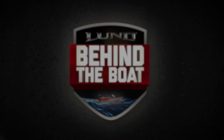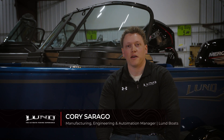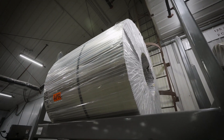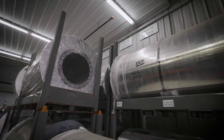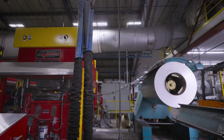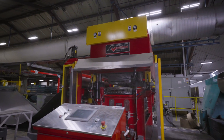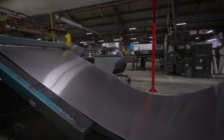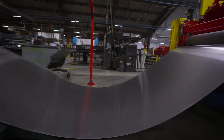The decoiler is one of the newest pieces of equipment we have in the PartsFab department. It's really where every 10,000 pound coil of aluminum starts. All of that material has a lot of memory saved in it, so the decoiler processes that coil through a set of sheet levelers. Each leveler has an individual sensor that senses pressure differences and applies a specific force to flatten that sheet out.